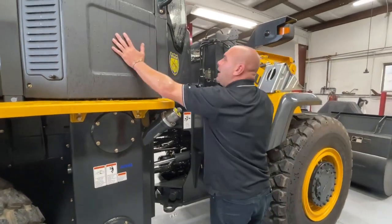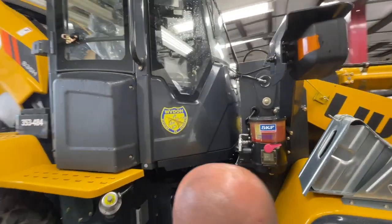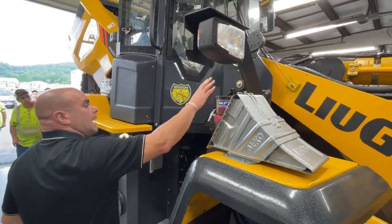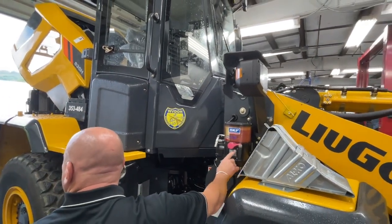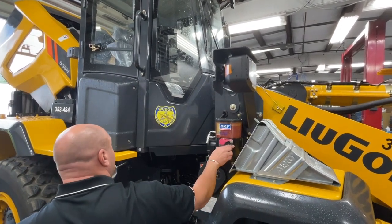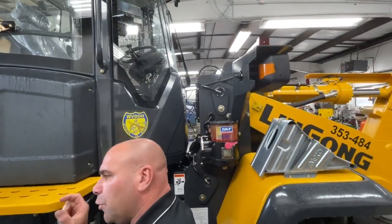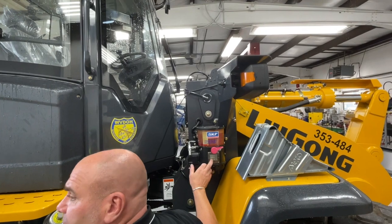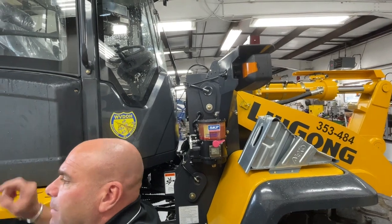Okay? Again, behind here is all the air conditioning components. Your hydraulic level for your hydraulic tank, again, AW46. Everything is outlined in the manuals on the levels and the checks. Your SKF lincoln grease system. Again, you pull this little cover off, you can make some changes right in this little diagnostic panel for more or less grease. Okay, and it's in time. These little progression blocks, there are different spools in there to give more or less grease. Okay, you guys don't fool with them. You're just going to fool with the timer. They've already done all the engineering to figure out what spots get the most grease.